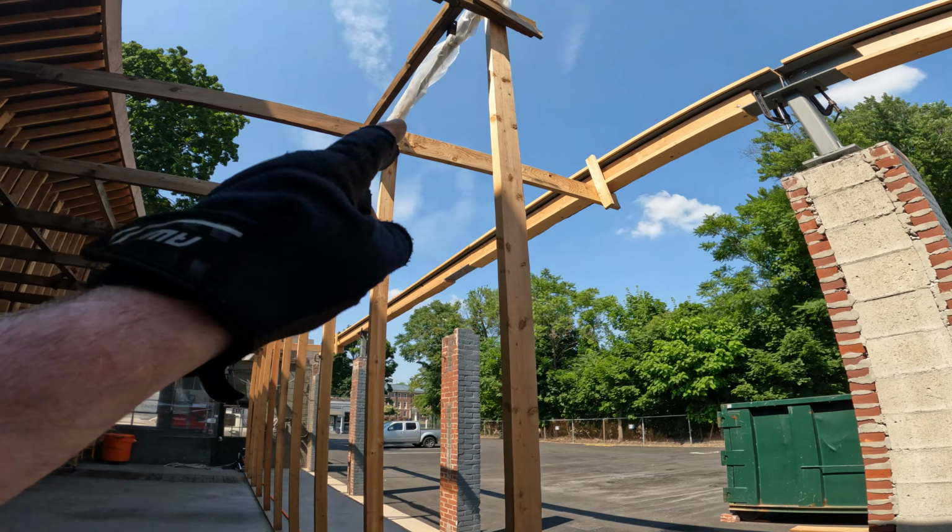So this is what I'm worried about for those two. We started banging down that metal post to get it down where it needs to be, and that's when we had to stop to help get the lumber order out. But we're already rubbing against the side of those holes, and we're trying to tap it down with a hammer, but those bricks are in rough shape up there. Every time we hit that down and we're pushing those bolts to the side, it's putting that load on those bricks too. And that's what happened over there, and it busted it out. So not sure how it's going to work. These two, I suspect, are going to be the same. So we'll see, we'll get it done.